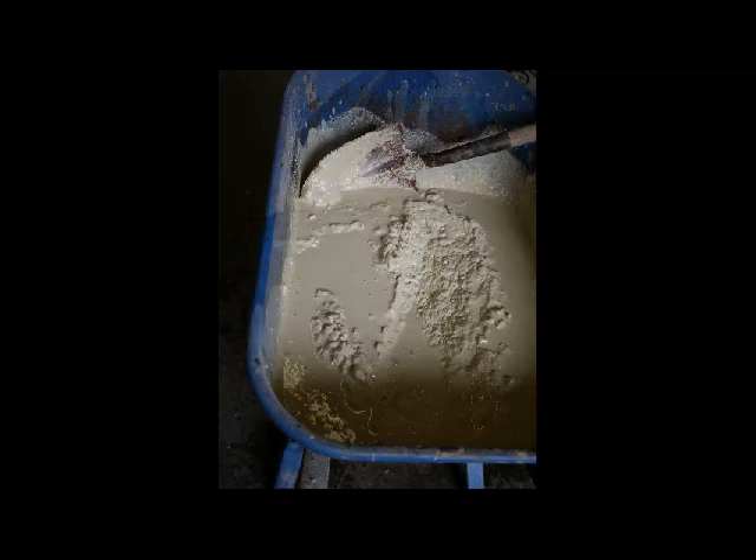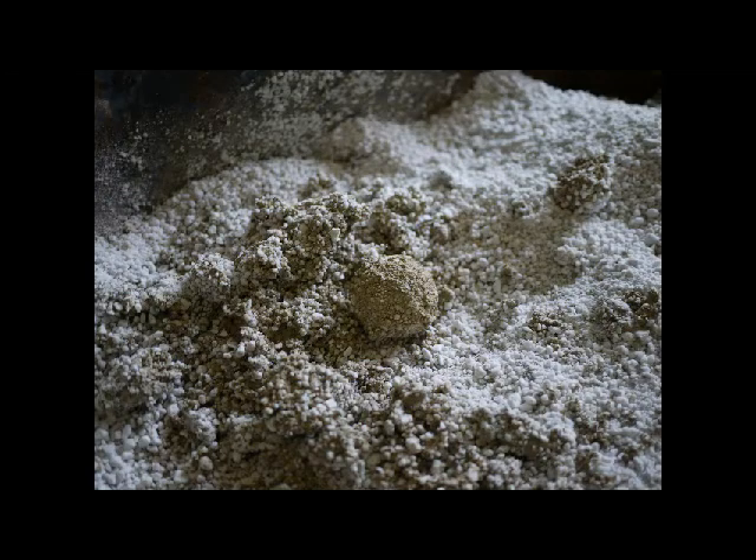There'll be mud coming later to seal the edges, so if you want to put a little there to level it or seal it, that's fine. Then you want to make your clay slurry — make it really wet. You'll be surprised how much the perlite dries it out. Let it be pretty wet; you can see it's kind of like a puddle. I dragged my shovel through it and it still holds a little bit of shape, but it's wet, and I even added more water after that.